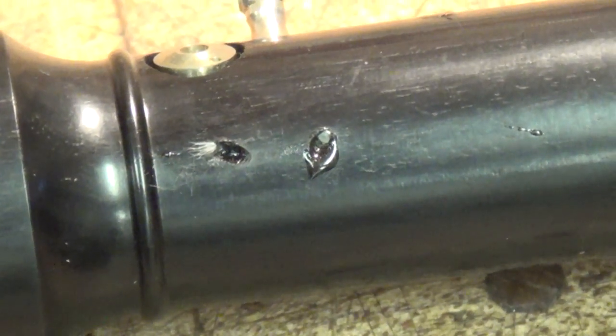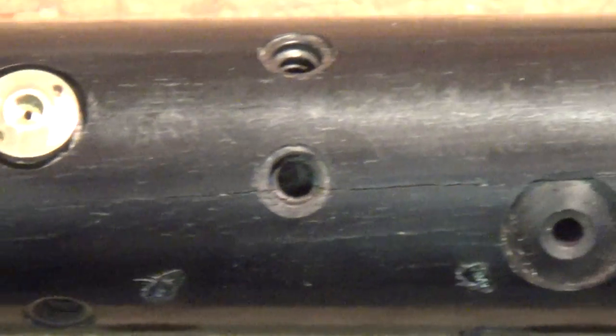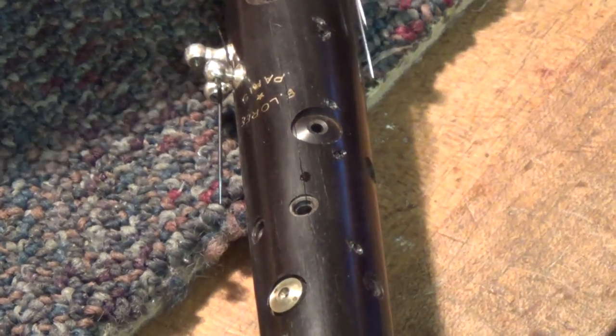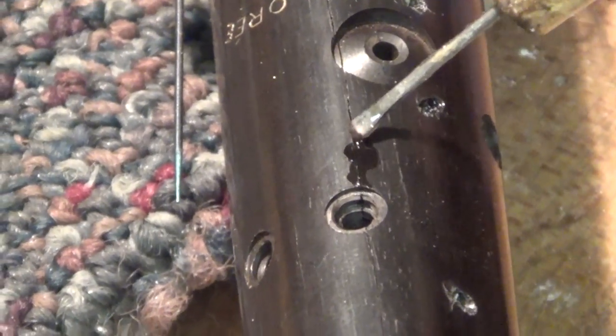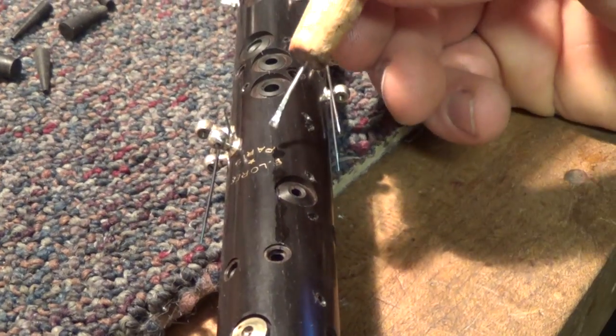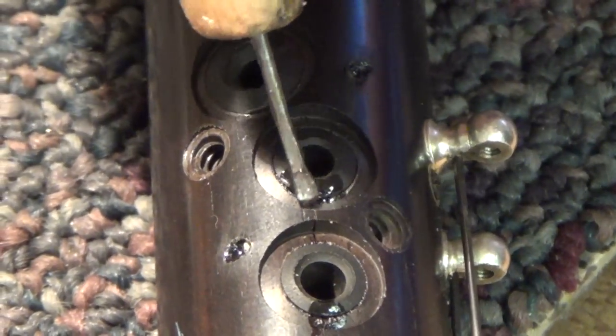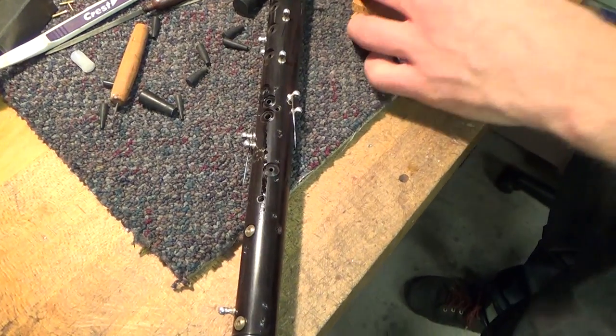After the crack has been pinned, we then open it back up slightly in order to fill it in with some very fine cyanoacrylate, also known as super glue. We fill around the inserts as well as in the crack. Final step is the cleanup process.